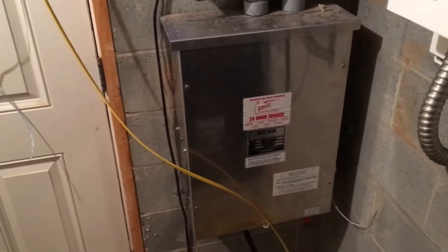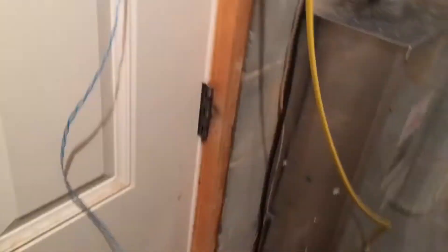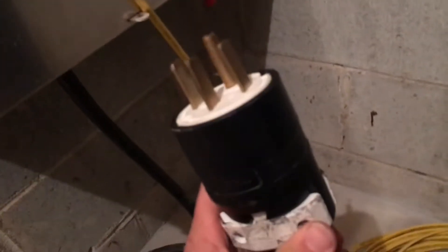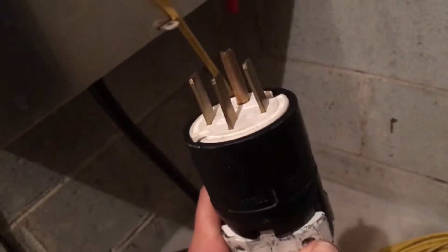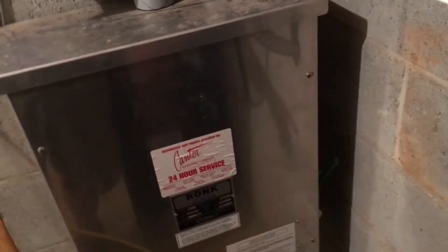This system's kind of cool. It already had a 200-amp manual transfer switch — it's a giant transfer switch — so when the power's out and the batteries get low, the customer is able to take a plug and plug it into the underneath of this monster generator. There's a plug down there for 50 amps, and he plugs it in there and can feed power into his whole house with the green switch in the down position.